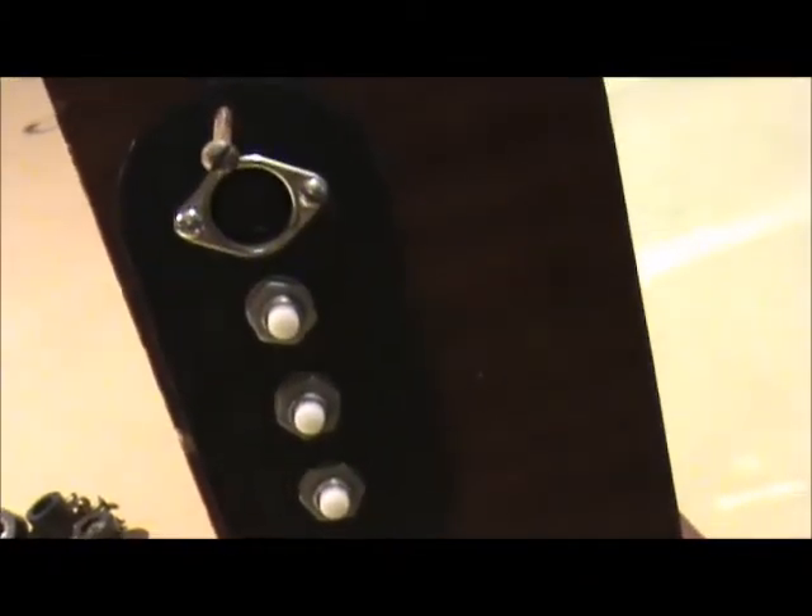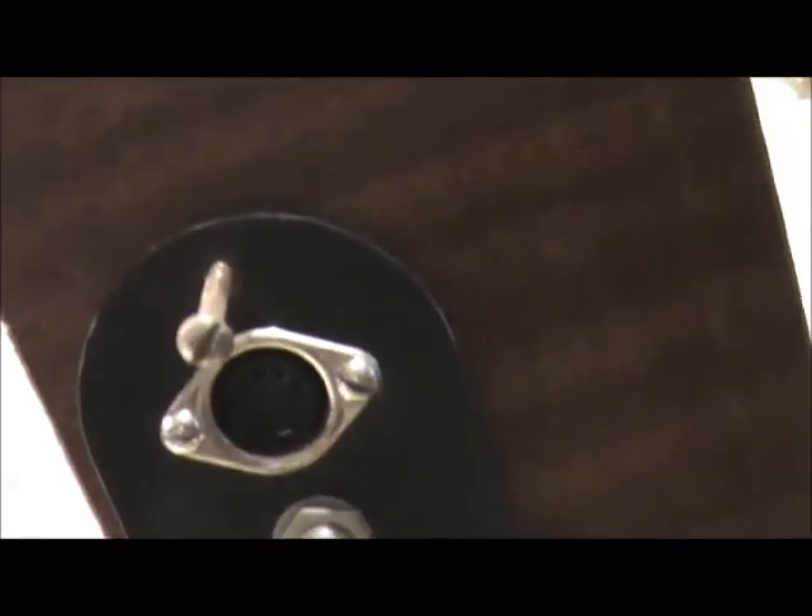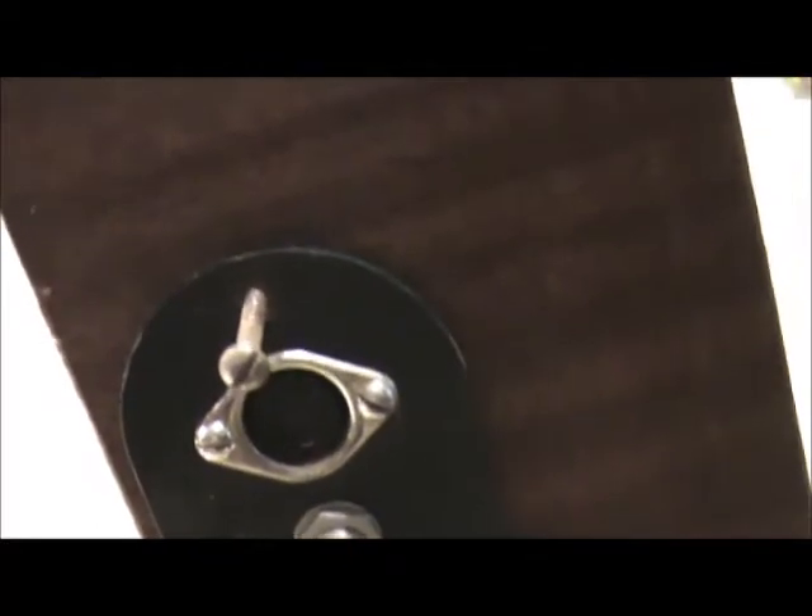I may have to refresh the filter capacitor — take that apart and figure out what's in there. It does look like it has battery backup; I guess those are D cells. We have set functions: hours and minutes set, and the other one seems to zero out the minutes. I'm not really sure what the function of the plug is — maybe somebody can chime in on that.